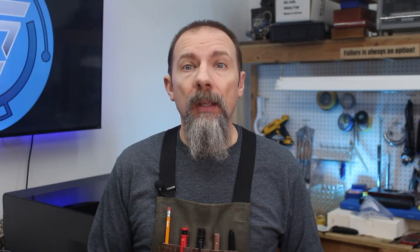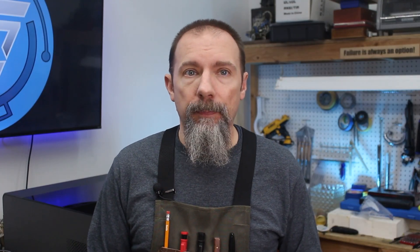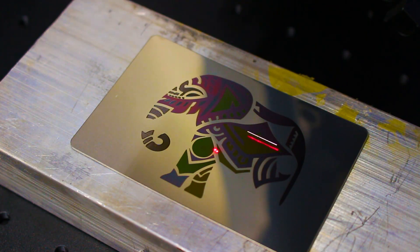Let's round out our laser types by talking about one of the coolest lasers. Often coveted by laser enthusiasts because it can deeply engrave and cut thin metal, this laser type has one huge advantage over the other two. Diodes and CO2 lasers cannot cut or engrave on metal — they can mark metal, and some infrared diode laser modules can scratch the surface of metal, but none of them compare to the ability of a fiber laser. If you're hoping to cut through really thick metal stock, you're going to need an industrial gantry fiber laser, and those are not cheap — cost-more-than-a-house not cheap. Engraving on metal is really a fiber laser's shining ability. They're also able to make colors on stainless steel more reliably and with greater range than a diode laser. You'll want to get a MOPA fiber laser if your main goal is to color stainless steel — it's a lot easier and you have more control over the colors. The GI-30 I have here in my shop is a MOPA fiber laser.